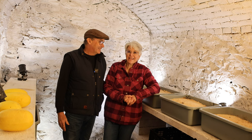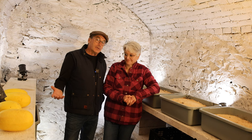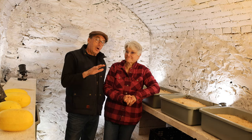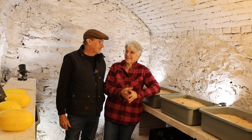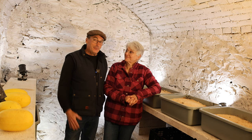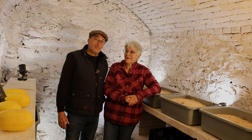I'm just so thrilled to finally have a fully functioning root cellar in my farmhouse. Going forward, we just have to learn when and where to put the produce — the root cellar is colder and damper at 45 degrees and 100% humidity, versus the larder which will be drier at about 50 to 55 degrees and 50 to 55% humidity. There's a perfect place for everything. Thank you for joining us on this journey, and we look forward to reporting more on our experiences using this root cellar. We'll see you in the next video.